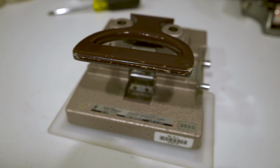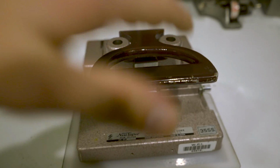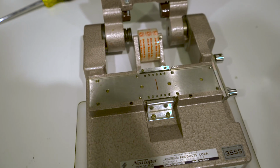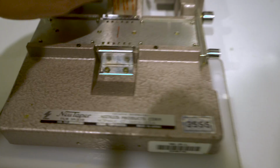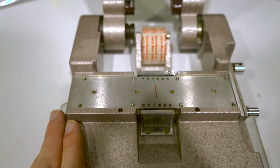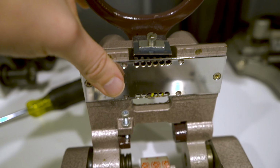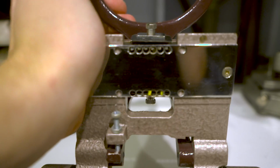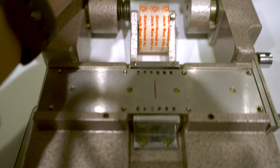This is a 35mm film splicer. It is designed to cut and attach 35mm film. In this case, when we are assembling or disassembling a 35mm reel, you're going to need to tape it, which, this is the tape, and do it in a proper fashion that won't interrupt the picture or get stuck. This is designed so that not only is there a cut motion, but also, it's hard to see, it's supposed to be a punch motion. So you can see the blade and the teeth. They go right through those holes right there.